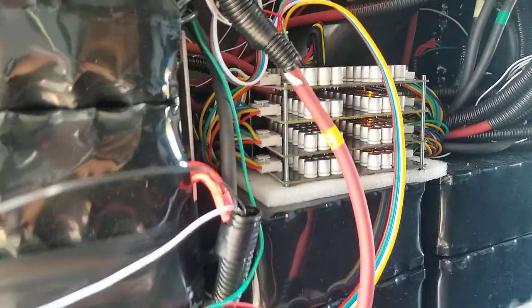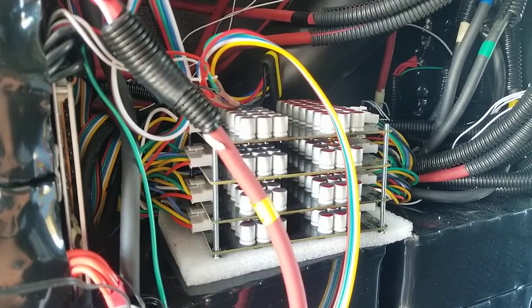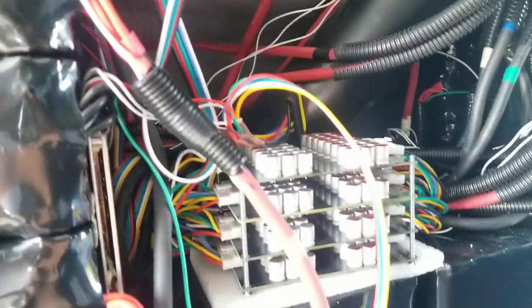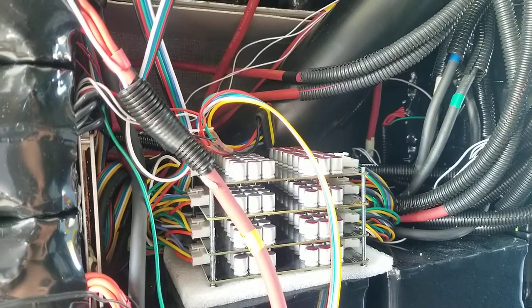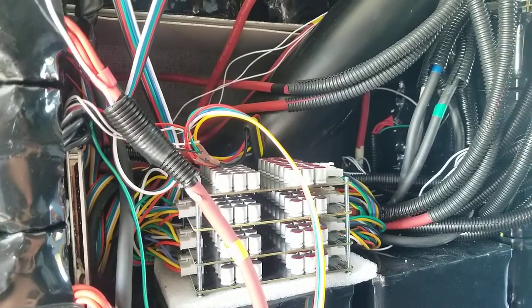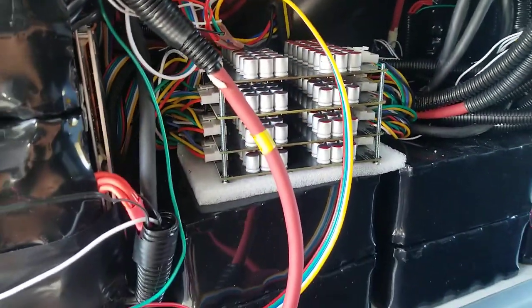So what you're looking at there is the active capacitor balancer. That is a 5 amp version of that, and it uses the 16 gauge wires that you see running there. Those are ribbon cables, and those run to all of the cells, and they make sure that each one of the independent battery packs is completely balanced through its life cycle, kind of stealing from the highest cell to give to the lowest cell. And it uses that capacitor bank right there to do that. So it's pretty cool technology.